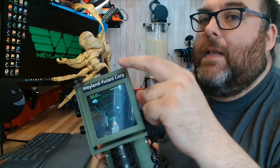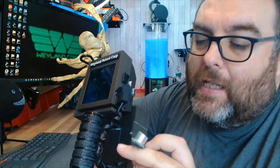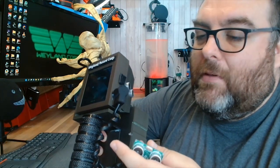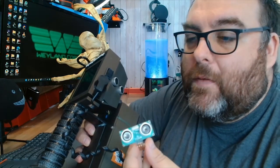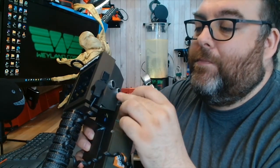The next thing I wanted to mention was having some modularity on the project. Think of the screen as one module — if the screen gets damaged you can pop it out and replace it. I also made these HC-SR04 ultrasonic sensors into little modules by soldering them onto a bit of breadboard with their own resistors, and all the cables coming off them going into screw-down terminals that connect to the Raspberry Pi and power. What that means is if one of these sensors goes down — and they are kind of fragile — I can easily open this up, pop out the sensor, plug in a new one, and we'll be back up and running again.